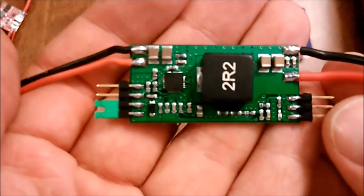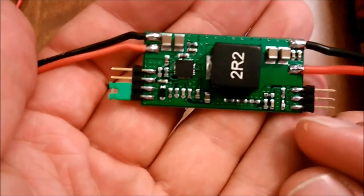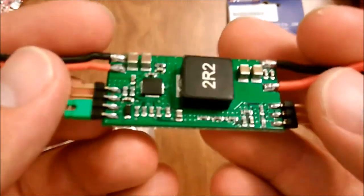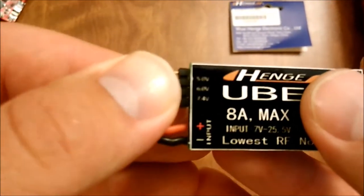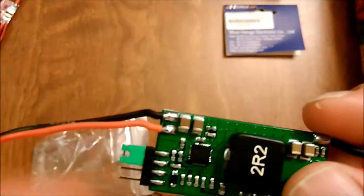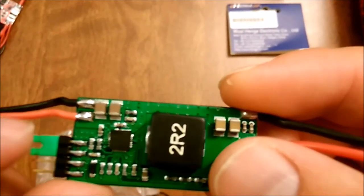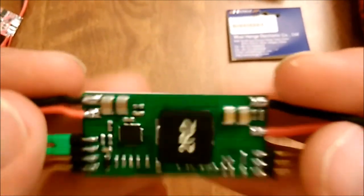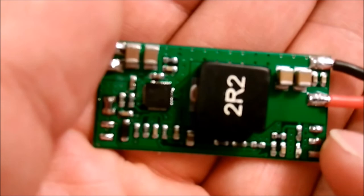I took off the heat shrink here. These are the so-called output enable voltage jumper pins. I'll probably just end up unsoldering these because I'm going to waterproof it, so there's no point having pins sticking out. Keep the little label on at least until you figure out what you're going to do. In our case we're going to go 7.4 volts, so I'll put the jumper there — these last two pins closest to the wires. I'll probably just use some solder to bridge that, like I did on my last one.